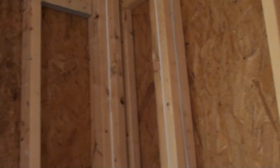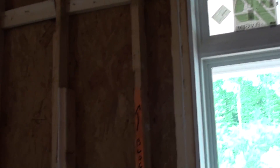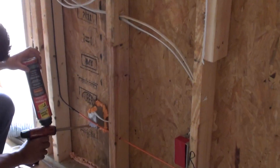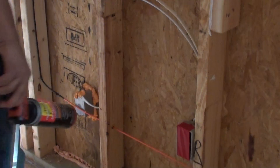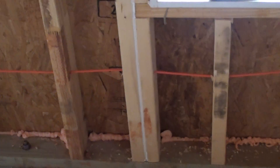That is the case everywhere you have that condition — as you can see the bead of caulk all the way on the top plate coming down, and here the installer is foaming around those electrical outlets, and then we have the back of the bottom plate foamed as well.